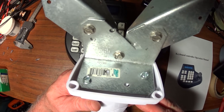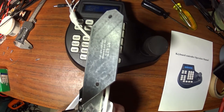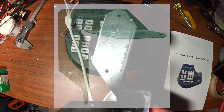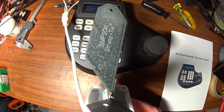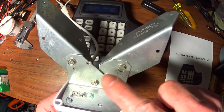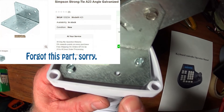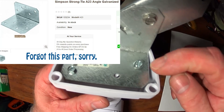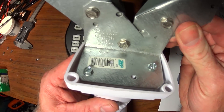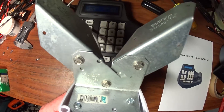I've come up with an interesting solution. This is a Simpson — the number on it is RTA-2Z — and it's a Simpson corner tie for roughing in lumber, basically for truss work. It's a structural tie. What I've done is taken two of these, screwed them together, and made a mount. You have to make sure when you're screwing into the plastic mount that you're not screwing into wires. I've just screwed into the two holes available in this folded sheet metal piece, put two machine screws in. This mounting costs about three dollars to make, maybe five or six minutes to drill holes and screw it together. It makes a fairly good mount for these kinds.